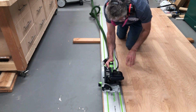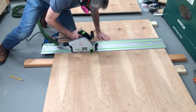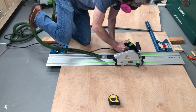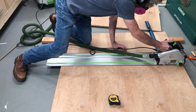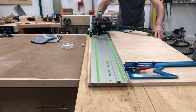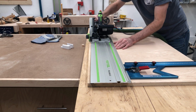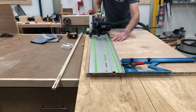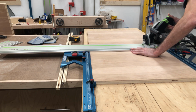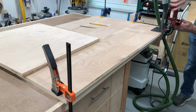I only have a job site saw, and so I find it a lot easier to break down plywood using my track saw and TSO guide. If you haven't used TSO guides, they're worth checking out. They're accurate beyond belief, and so I cut to my exact measurement rather than having to refine cuts on a table saw. You can also cut narrow stock using the guide as well, but when dealing with narrow stock, that's when I prefer the table saw, as those cuts can be controlled much better on a table saw.